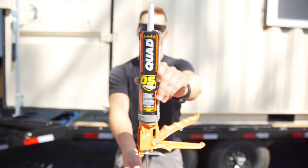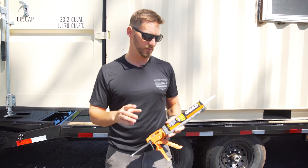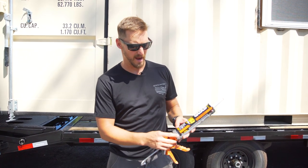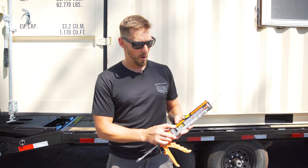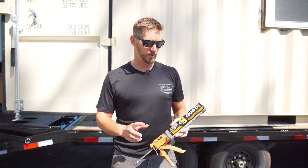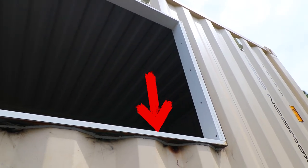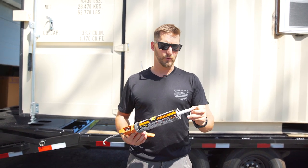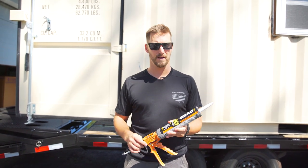Okay, so for all of our window frames, once they were all nice and welded and cooled, had time to cool down, we spot treated the welds with the rust inhibitor. And then we went ahead and applied this quad. It's made by OSI, tougher than the elements. It's just a super insanely all-purpose sealant. So for windows and trim, I haven't found anything that outlasts this stuff. It's pretty expensive and it's very difficult to work with. It's super messy. It takes like 3 or 4 days to dry. It leaves it looking like a weld around the window, which was kind of nice because it looks like a big, huge weld all around the entire frame, but it's also an insanely strong sealant for waterproofing.